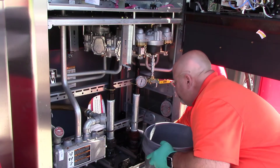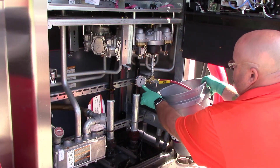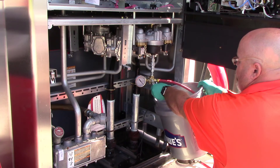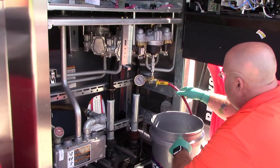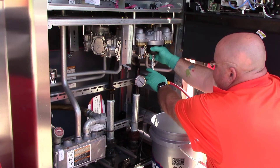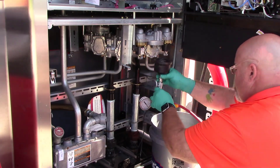After you've finished with the pressure testing rig, trip the shear valve. Open your ball valve and you can see the pressure drop and drain out of the testing rig. After you've drained the rig, just unscrew it from the filter manifold and drain any remaining fuel from it.